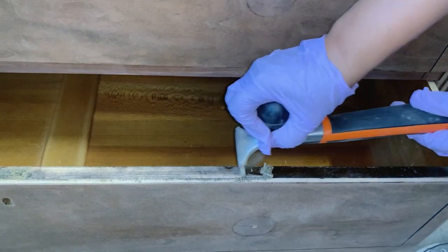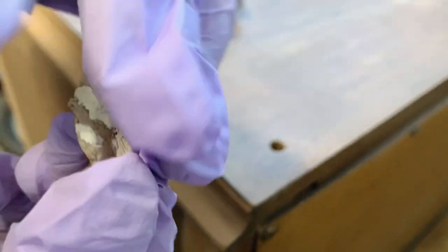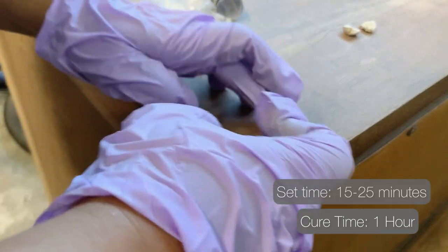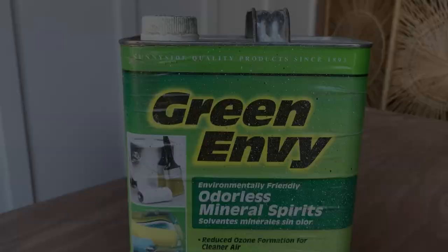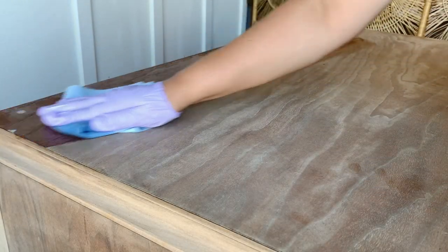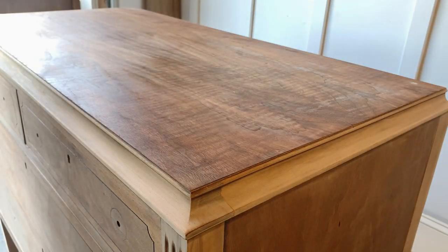For the last few repairs I'm using QuickWood. All you have to do is knead this putty with your fingers until it's a uniform color, then press it firmly to the surface to be repaired. After an hour or so, I came back to sand it until smooth. To make sure my piece is super clean before treating it with a color wash, I'm using Green Envy mineral spirits. Make sure the mineral spirits has completely dried before you treat the wood — I normally like to wait overnight before applying paint or stain.